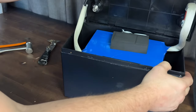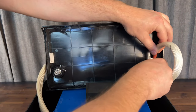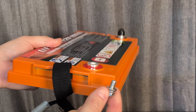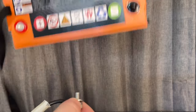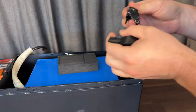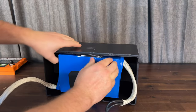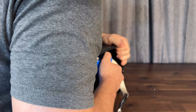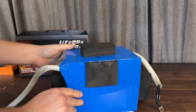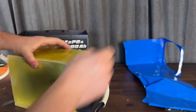Alright, popped this off pretty clean. We're going to go ahead and disconnect the battery cables. These come with M8 millimeter bolts, which are pretty good — you can definitely put a lot of ring terminals on here, they're long enough. Now since this does have a 100 amp discharge current, we'll tape this up for protection. Pulling it out now — it's glued — alright, there's the little box. Setting that aside, now we need to get the shrink wrap off, just cut it off, and we can see the epoxy board underneath.